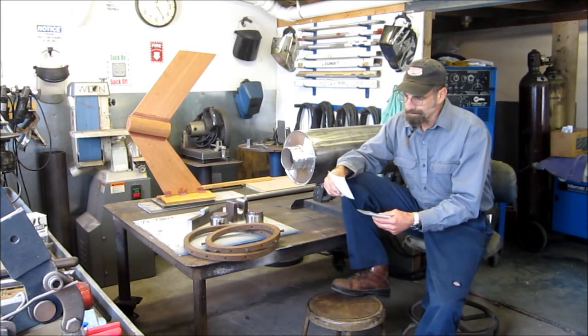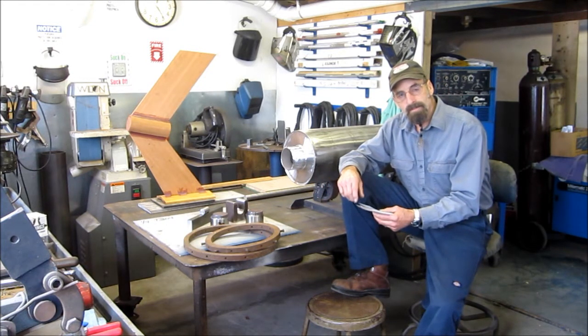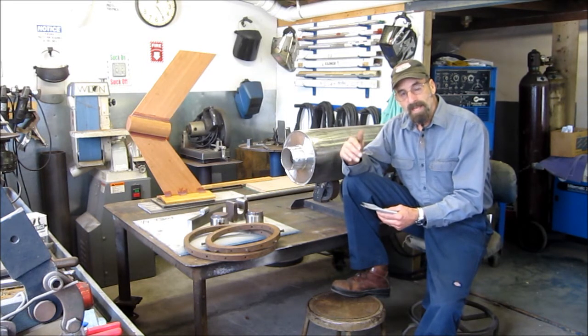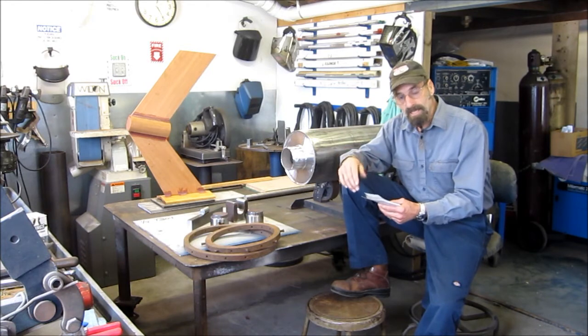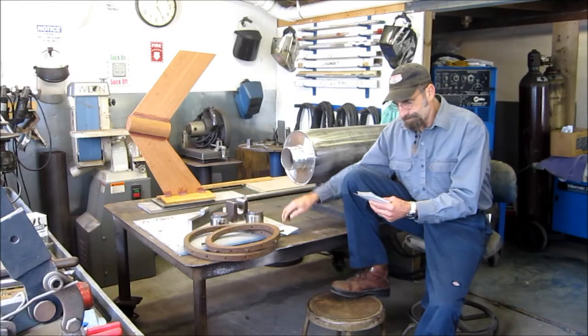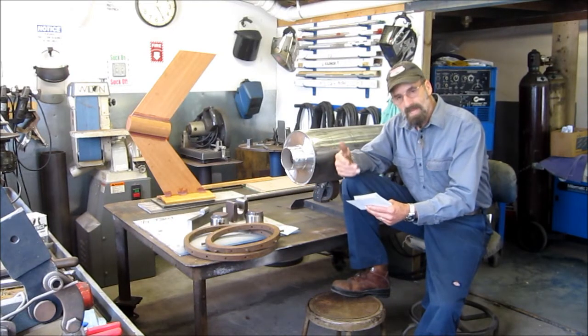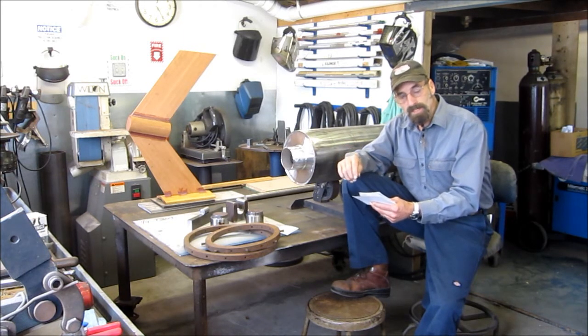The first photo is the pipes when they first arrive at the yard and they are laid out there. On the larger of the two masts you can see at the very far end the second section that will be added together. The next photo here shows the butt joint, the sleeve inside the pipe and my rosette weld cutouts where I am going to join the two pieces together.